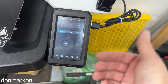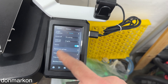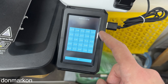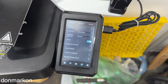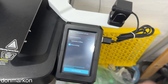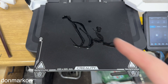You will get advice to wait for the bed to soak the temperature, but you really don't need to do that — at least you've seen my first layer, so trust me on that. Go into equipment self-test and repeat the auto leveling. You can pause the video and see how much the numbers have changed. This is the mesh you want to print with, so save it. My Z offset is perfect so I don't need to redo it, but if you are at this point you should do it. I'll show you how to adjust it to perfection, because just doing automatic Z offset is not enough for a perfect first layer.